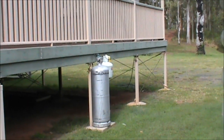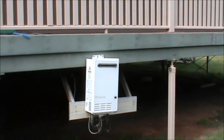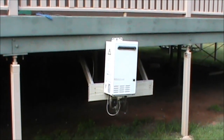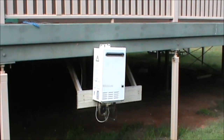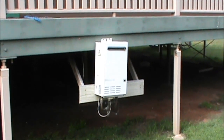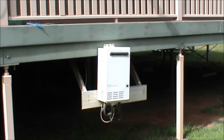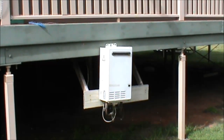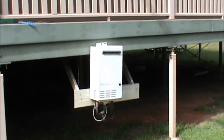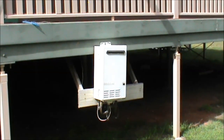This also provides gas to the gas cooking appliances in the kitchen. There's your solar hot water gas backup system. This is a fairly old system. Some of these work on the idea of using a pilot flame off the gas which burns all the time, and it's set up so that when you turn on a hot water tap inside, there are sensors that sense the tap being opened and the pilot light flashes up the gas heating to heat the water. There are more modern types where they don't have a pilot light — they just sense the water flow going through the system and it just flashes up and heats it as it goes.